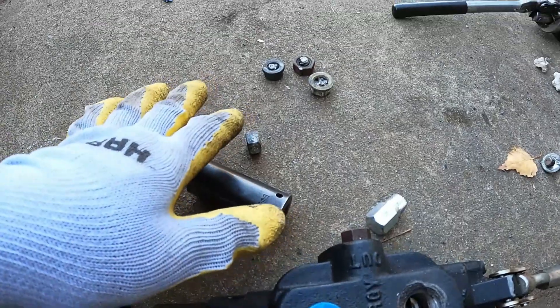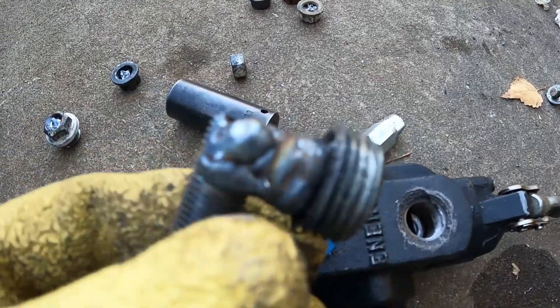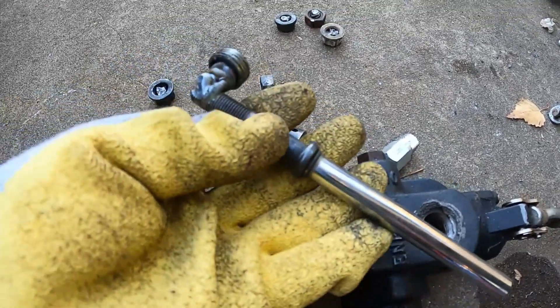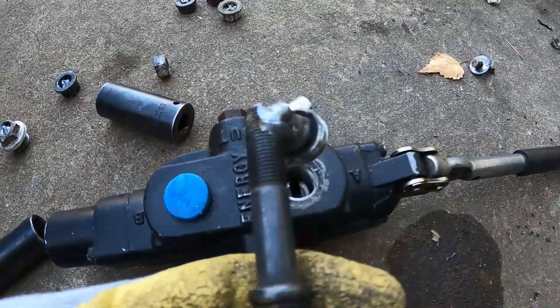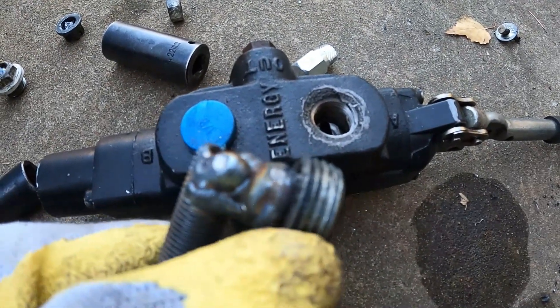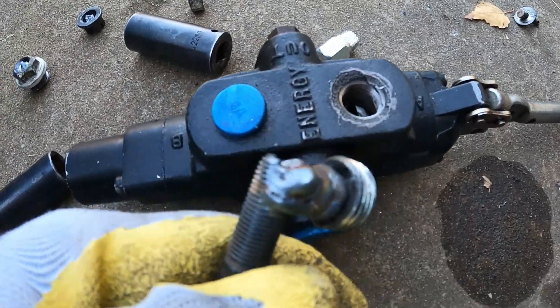Since I didn't have a bigger nut, what I did was keep welding it, extending it out further and further, which allowed me to attach just another piece of pipe onto it. I hit it with a hammer and it came undone. You can see the weld right here is nice and thick — it's holding on nicely, and that's how I got it off.